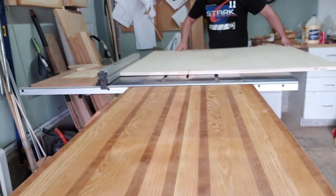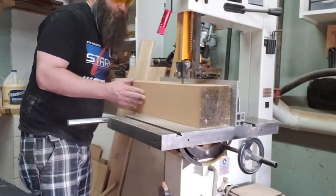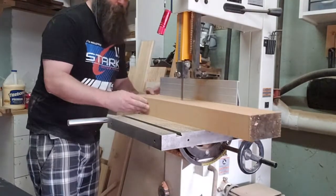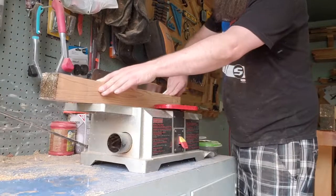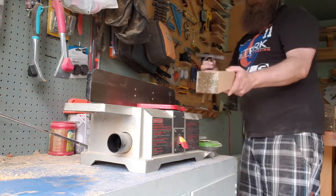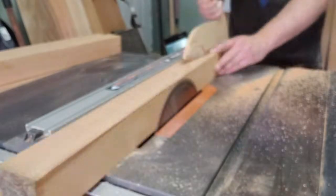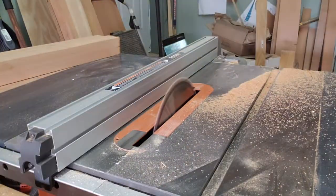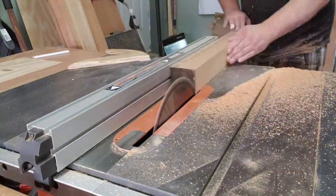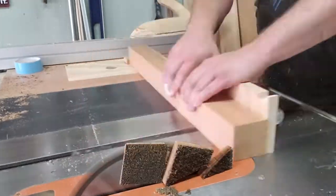We start by taking half of a sheet of three-quarter inch Baltic birch plywood and trim off whatever 48 minus 32 is, because it ended up being a 32 by 32 inch top she was looking for. Then I ripped down the rest of that six-by-six piece of cedar I used for legs on my outdoor benches into four bits for the legs — 28 inches long, which is just about perfect for a table height. Joint and rip the opposite side, plane them, get them all square. Four legs, 28 inches by about two and a half inches after all the milling is done.